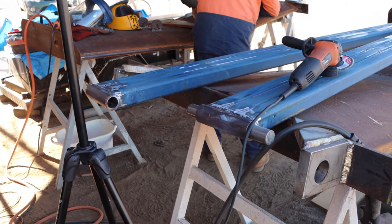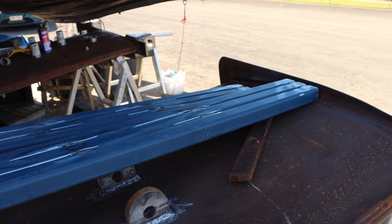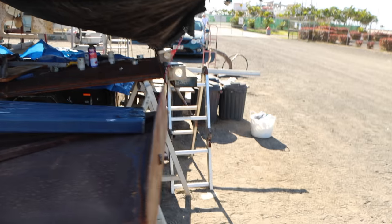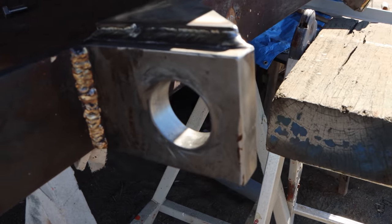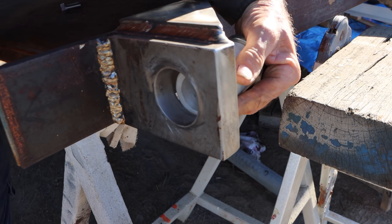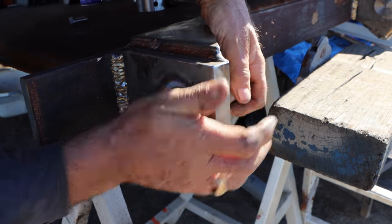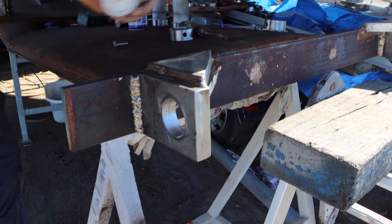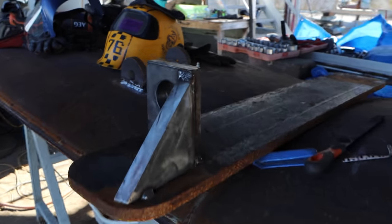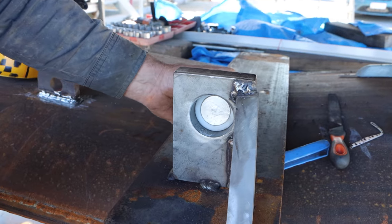Time for a progress report — we've been going at it for most of the day. Don has got the pins welded onto the arms, the arms welded together, and everything's true, straight and lovely. Over the back here, this hinge has been filed out, sanded out and cleaned up lovely, and the pin now basically fits — it's tight, but that's perfect, that'll work. That's not going to be a problem with galling because of that plastic. We're still to get it to fit through this side here, which is proving a bit of a problem but it's very, very close.